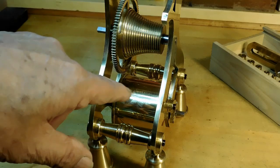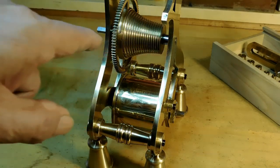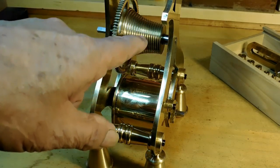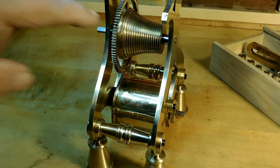Springs are much better today than they were before, and you have the adjustment on the pendulum, so you don't find that many clocks with fusees in them right now. But this clock has a compound pendulum, which is a little bit different — you can't change the length of the pendulum to change the swing. So in order to get the clock to run faster or slower, you need to change the torque, and it's very important that you keep an even line here to keep the time even.